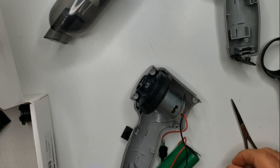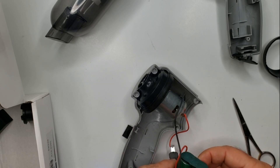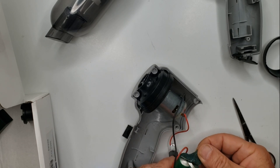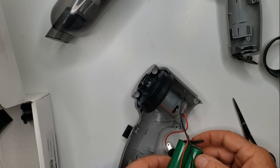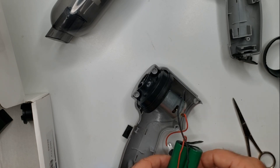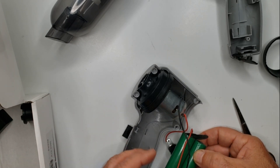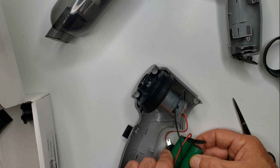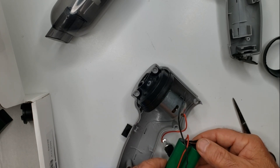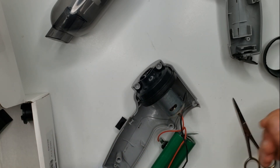Using little scissors, I opened up the cell and it appears we do have two lithium cells here, going from positive to negative — so they're actually in series. Applying eight volts would allow four volts to each one. As a hobbyist I'll sometimes do something like this, but not in anything that's going to have a lot of draw, because balancing these cells cheaply can cause problems, especially with charging circuits. But perhaps because of the low charger voltage it's not a problem — I wouldn't do it that way, but that's the way it is.